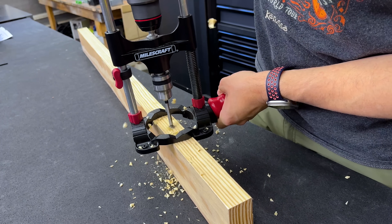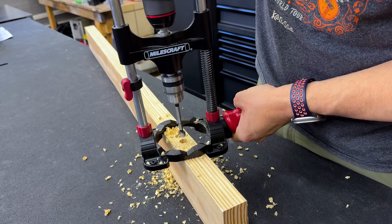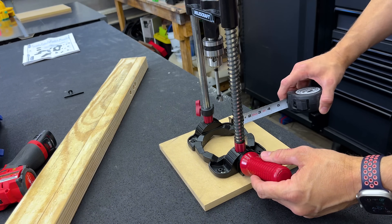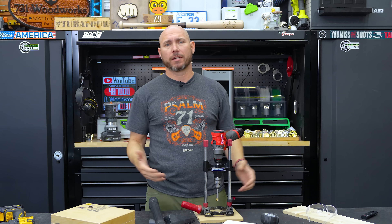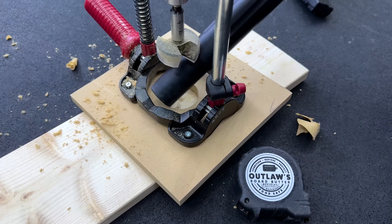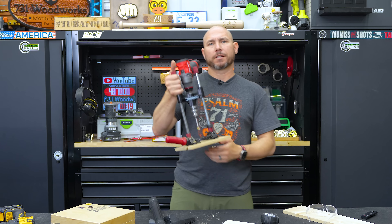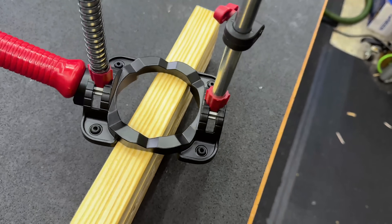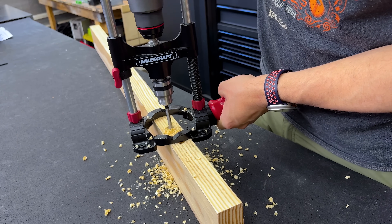One thing a lot of people miss on something like this is you can add to it to make it more functional, very simply. I just took a piece of MDF — I'd actually recommend plywood, but I had this scrap piece — cut it eight by eight inches. You can use whatever size you want: 10 by 10, 12 by 12. The bigger, obviously, the more stable, but it'll take up more room. Then I took a Forstner bit, inch and seven-eighths — you could choose two inch or inch and a half — and drilled it all the way through. That gives you a lot of stability, because the base of this is kind of small, so if you're trying to drill holes on thinner stock like a 1x2 or 1x3, you'll need a little more stability.